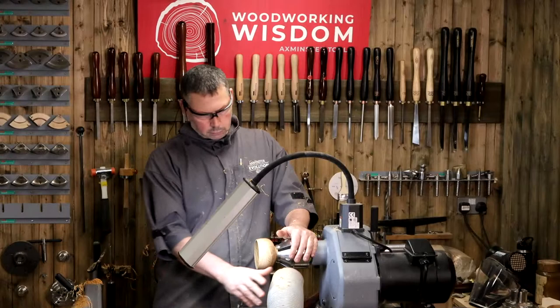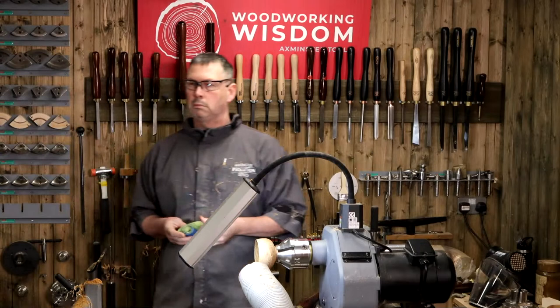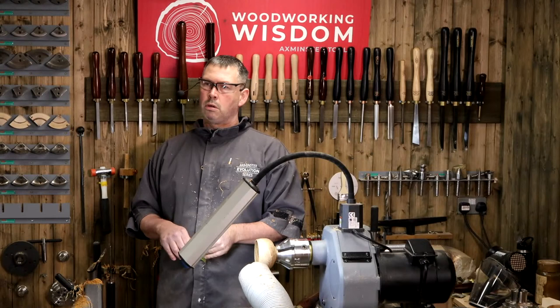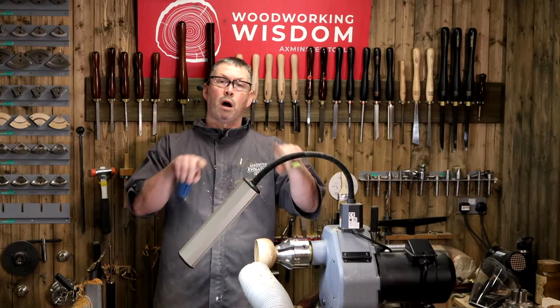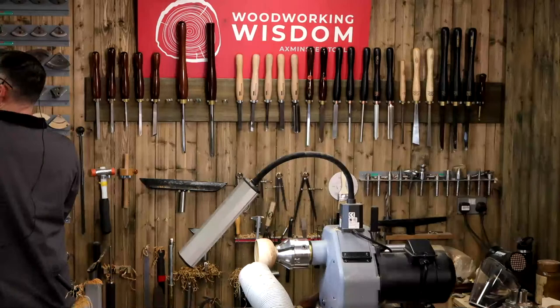So a question here from Malcolm. He's asking, can you post-fit the locking collar to the SK114? So could you fit one of those collar fittings on an old 114, or does it have to be machined as part of it? Because the 114s are machined as one piece. So the thread is all part of the outer part of the chuck. We do that purposely to stop any inaccuracies creeping in. So no, unfortunately, that is a separate chuck.